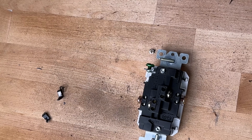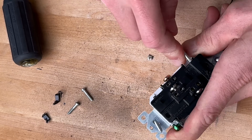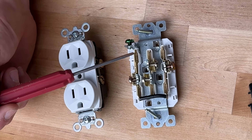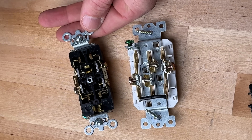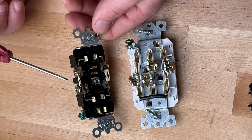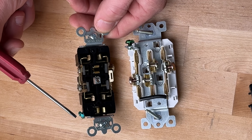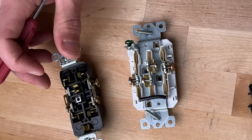In the meantime, let's open this up. I'm cutting two little slots in the screws holding the back housing to the front housing, then popping off a few clips to reveal the internals. Looking inside, I can right away say this is a unique outlet — I've opened quite a few residential and commercial grade ones. Here's my favorite commercial-grade Legrand 15-amp: it has two slots for neutral on one side, two slots for hot on the other, and a ground that goes to the yoke for your two ground prongs. That's the traditional design, and it's very robust.